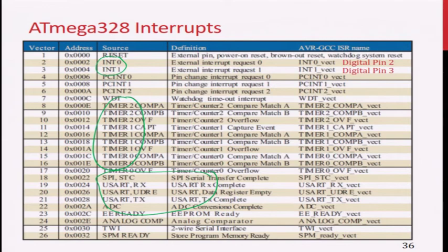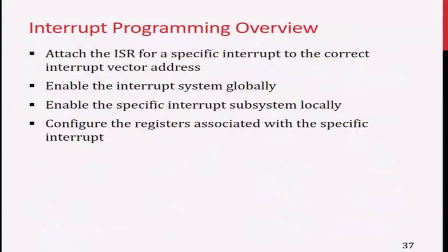And just now, remember I said there's an address where the interrupt vector will be stored. That is this address here. This is the address of the interrupt vector table. That means in this address is where I know the address of the routine to be executed whenever this particular interrupt is triggered by the peripheral device.